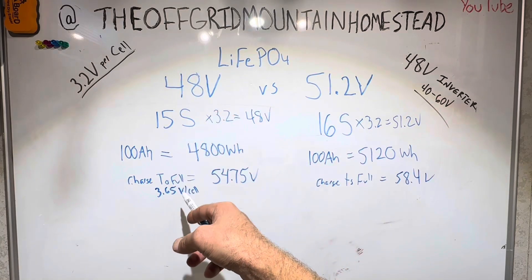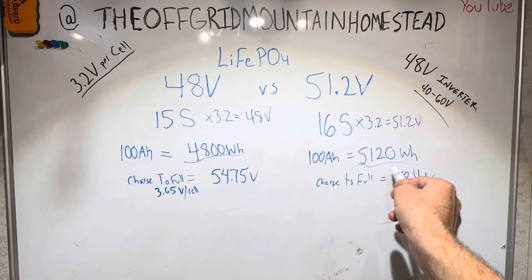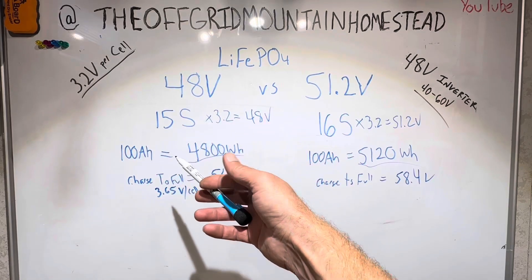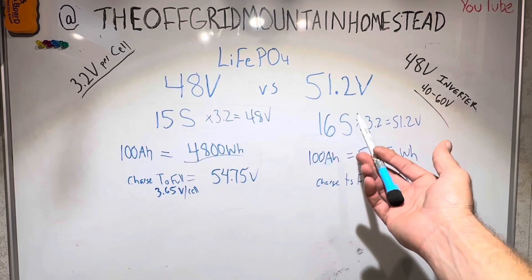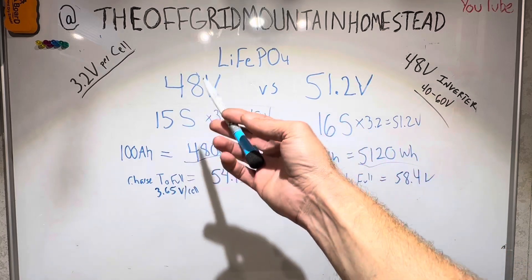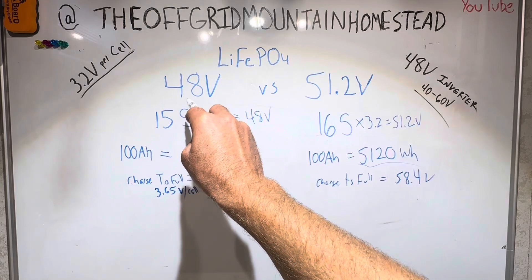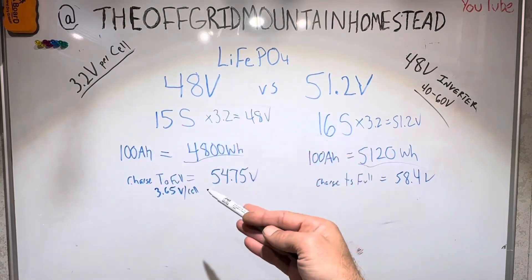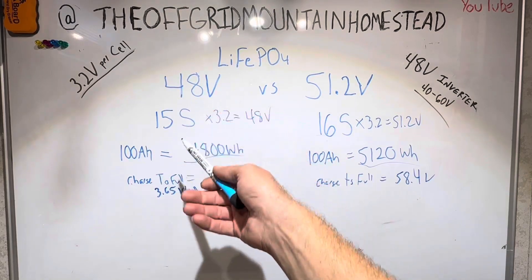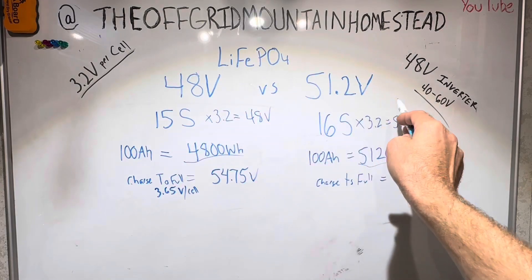If you were to buy and set up your system with a true 48 volt pack, the prices aren't that much different, but look how much less energy you're getting compared to the 51.2 volt option. Also, a 15S system wouldn't work with four 12.8 volt batteries in series — that four-by-12.8 configuration is the 51.2 volt system you want. A lot of golf cart batteries are marketed as 48 volt because the golf cart community refers to lead acid nominal voltage as 48, but if you look at their specifications, many are actually a 51.2 volt pack.